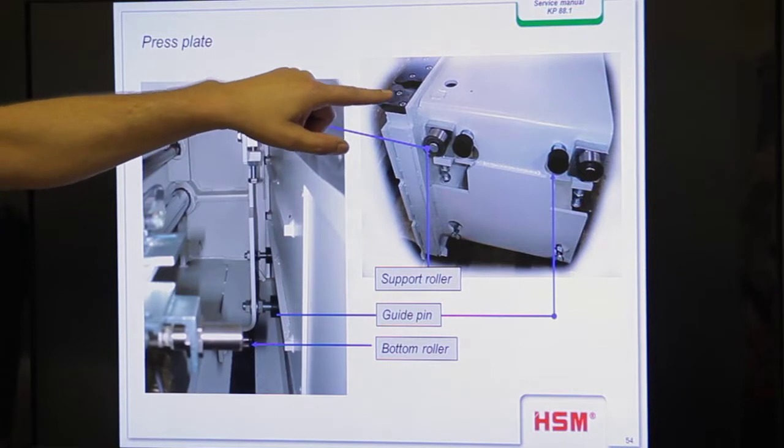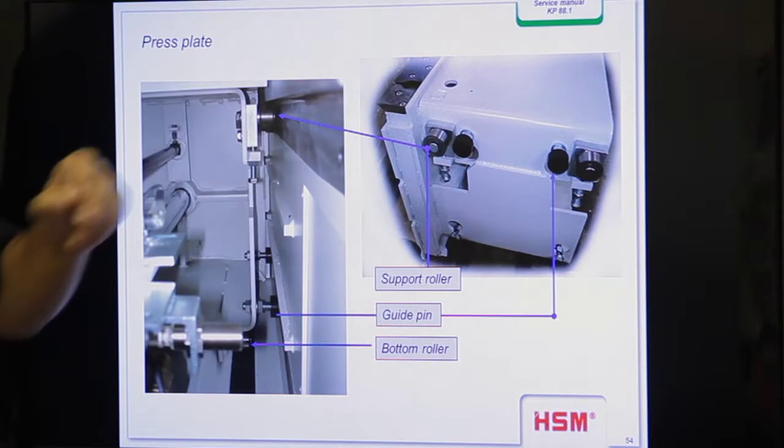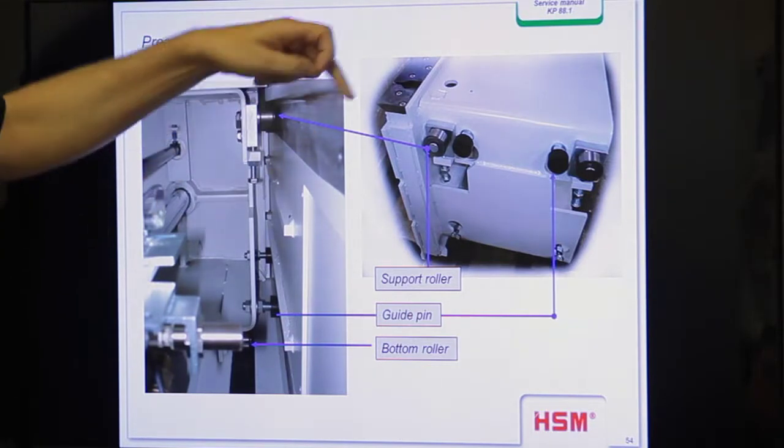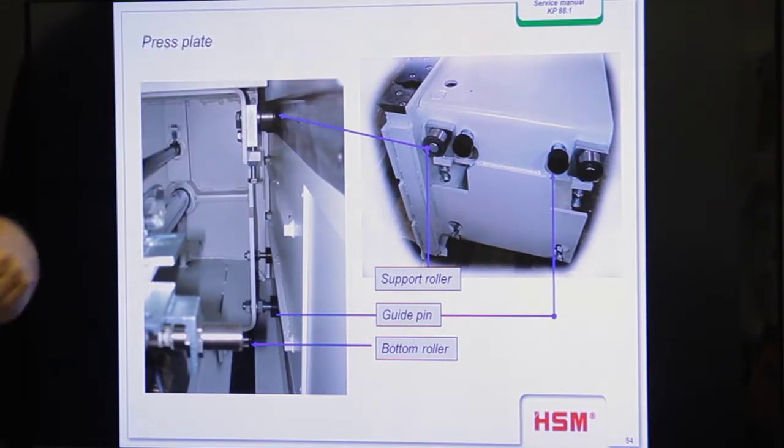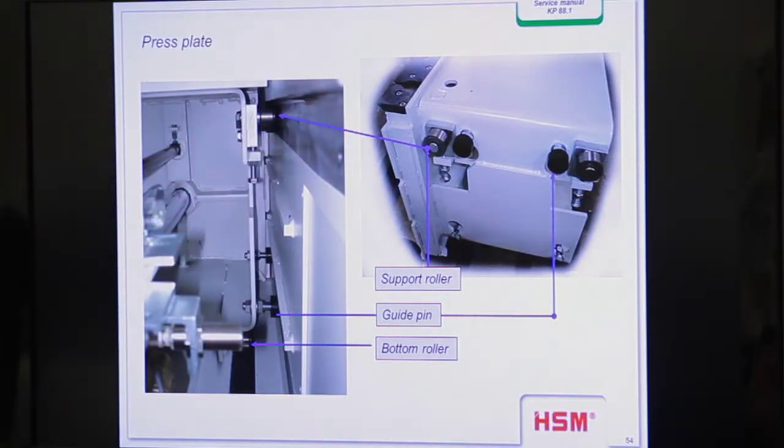And here on the top, you see the knives. The knives are more single parts because we have to go through the press ram, and here is also open space in front because the tape has to go out when the press ram goes backwards. When we have strapped the bale, the tape has to go outwards when the press ram goes to the start position again. So we have more single parts, and here is also a part that has a wear process, so you have to check if they're sharp enough, and when they're not sharp enough, then you have to replace them.